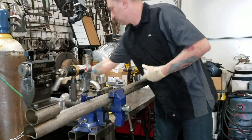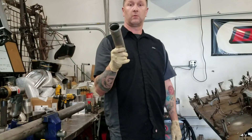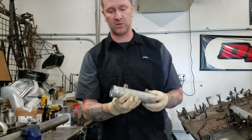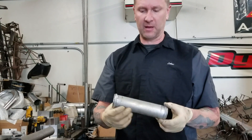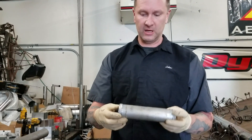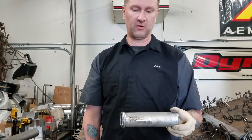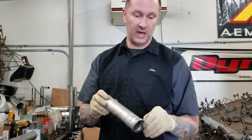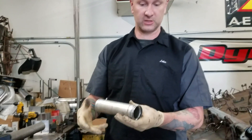So we're going to have to move over to a stainless steel pipe as a replacement for this. The reason this probably happened — the customer did this — I'm going to assume they went down to Lowe's or Home Depot and got a piece of aluminum tubing. It's pretty thin wall, and this is probably a harder material than what we use in the automotive industry, so you're going to end up with some flaking. The flaking will get into the system, and if I put this in a vice and pry on it, it'll just tear right across.